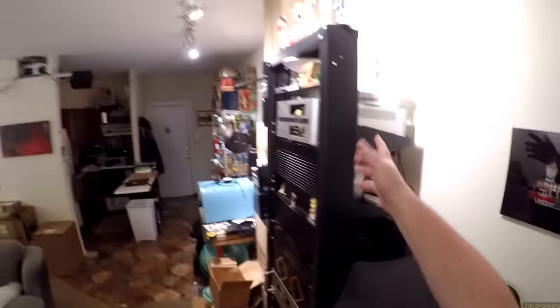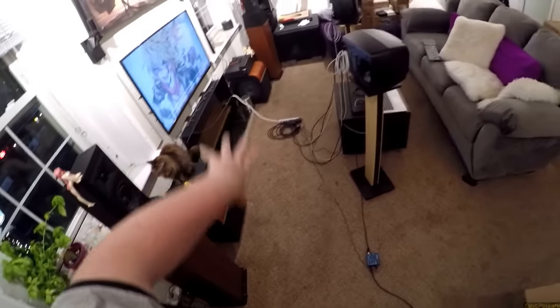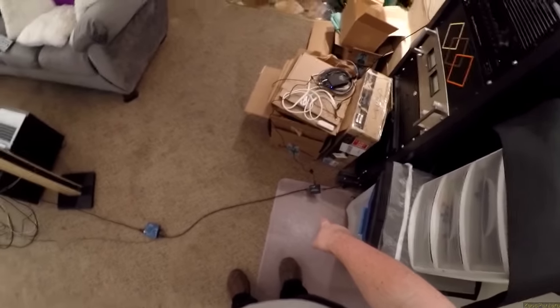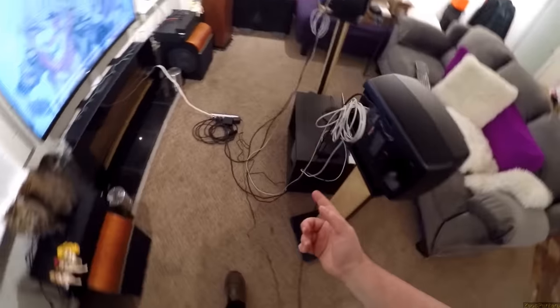Set up as follows, just real quick. My fiber optic out of my home theater PC usually goes down to the miniDSP that controls the amplifiers, the three Crown amplifiers to run everything. Now that's going to an extension, because I literally didn't have a fiber optic cable that went from there to there. So there's my three-way split, powered splitter, into the HOSA box, AES up, into the left speaker, which I'm using as a master, and you can use either one.